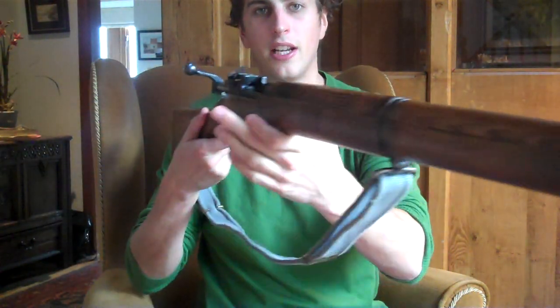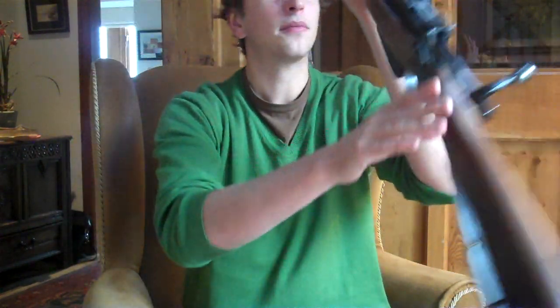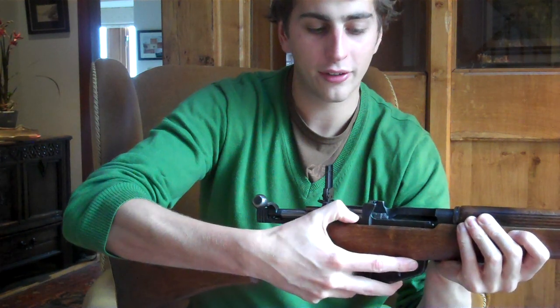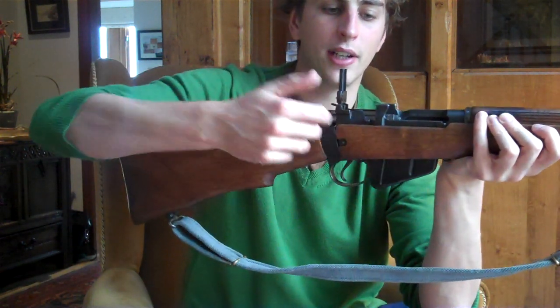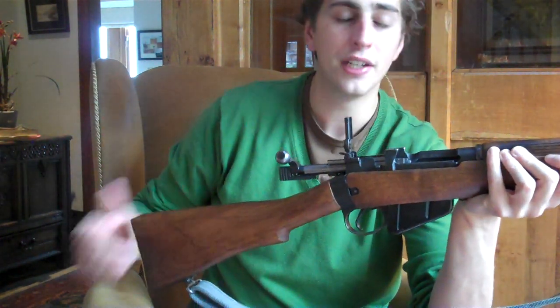But as you know, at some point roughly about 1939, the Number 4 Mark I — which this is one — was approved for service. So this rifle came into service and there are a number of differences between the Number 4 and the SMLE. It's got a slightly stronger action. The side of the action isn't actually rounded — it's straight — which makes machining easier. You've also now got a bolt release button here, which you simply press, bring back the bolt, flip up the bolt head, and it just pulls out, rather than physically clicking it out like you do on the SMLE.